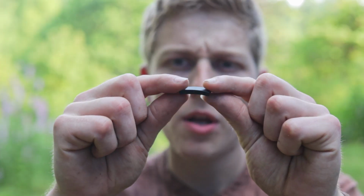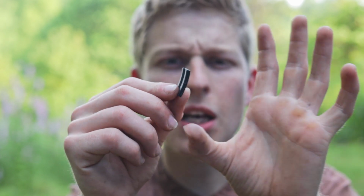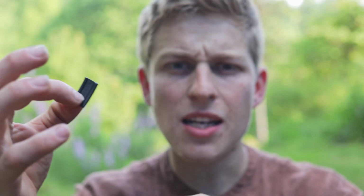I call it constant stress cracking because I've observed it on the front pin plates of my AR lowers and some other places where polycarbonate develops small fractures which grow over time under what should be a constant stress, which is a problem I don't have with PLA or PLA Plus or with nylons and other stuff. So what I ended up doing is I moved the clips over to using a carbon fiber nylon. Those of you who don't know, the clips are just these little dovetail sort of things that the hose clamps clamp together into pockets on the stock and the lower receiver that hold everything together. I use the same clips to hold the handguard to the upper receiver. Anyway, the polycarbonate clips develop small fractures.